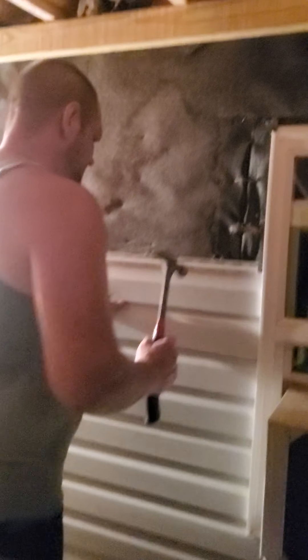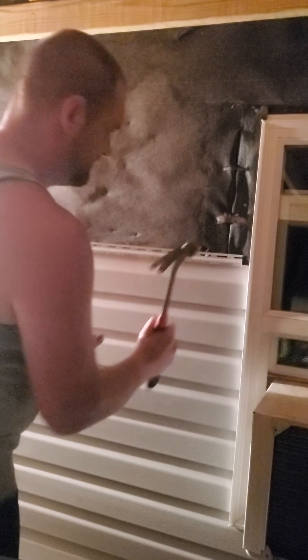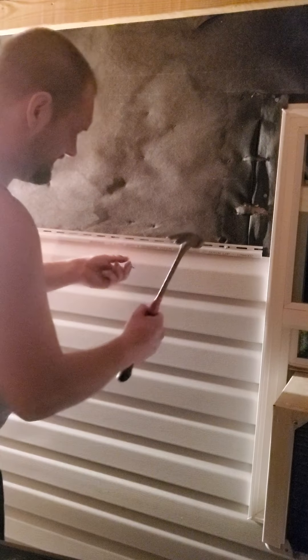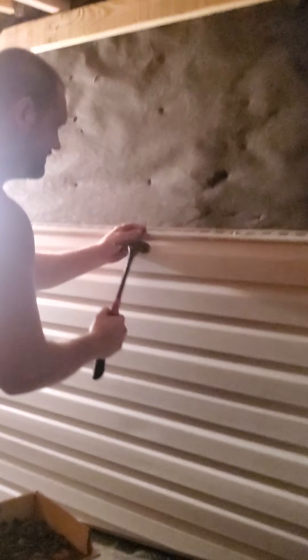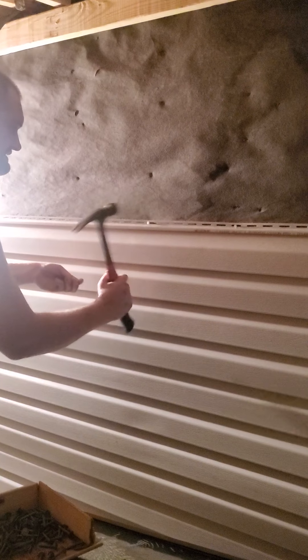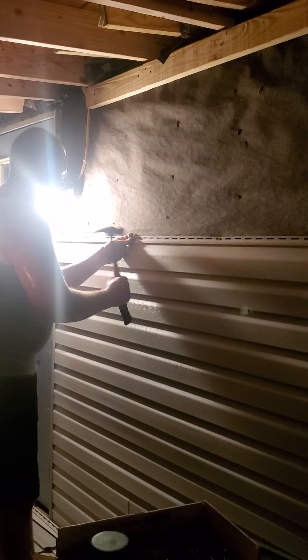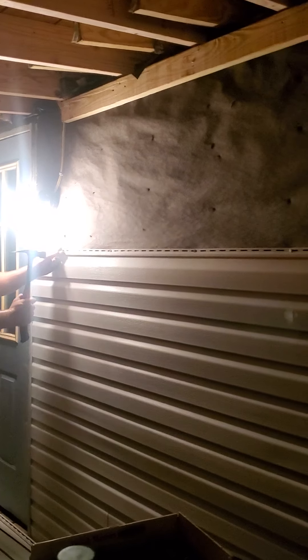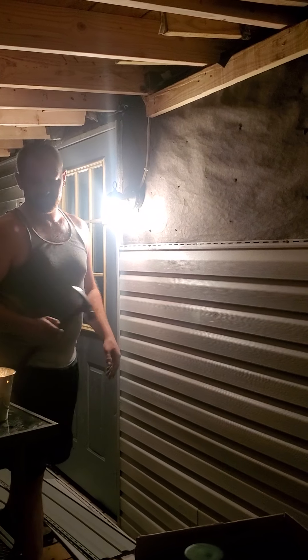Got me a handful of nails. To nail faster — a lot of people ask how I nail so fast. All I do is first center the nail in the slot. As you're hammering with this hand, you'll be twiddling this finger around trying to get your next nail ready. It takes almost half the time. There's two pieces. How long did that take me to hang two pieces? Seven minutes.